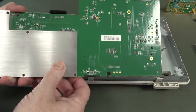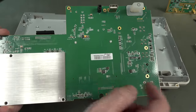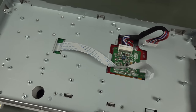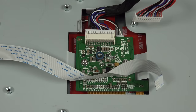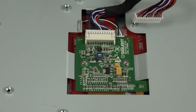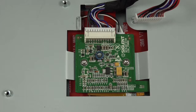Really nice construction - I like how it all just comes apart in a block. We've got our LCD driver board down there. This ribbon coming over here is for the rest of our front panel keypad. Alright, let's get ready for the rest of the RF board. It's going to lift off. Oh! A lot more distributed element filters. Looks like we've got some directional couplers down in here, as we've seen on the previous design.